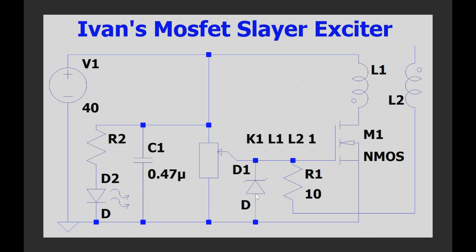In order to avoid these issues, diode D1, the Zener diode, quenches the positive voltage swings to whatever the Zener threshold voltage is. In my case, I'm using a 12V Zener diode. Although this can be pretty much any value — the maximum Zener voltage of this diode should be below the maximum gate voltage of the MOSFET, while being around two times larger than the threshold voltage for the gate. In my case, the threshold voltage for the gate is three volts, so it should be above six volts and below 30 volts. So 12 volts Zener voltage fits in perfectly.